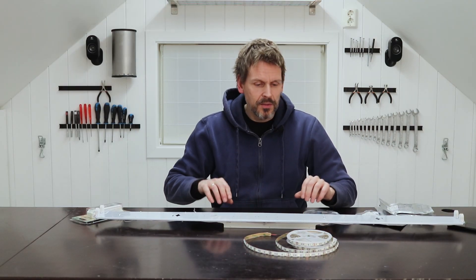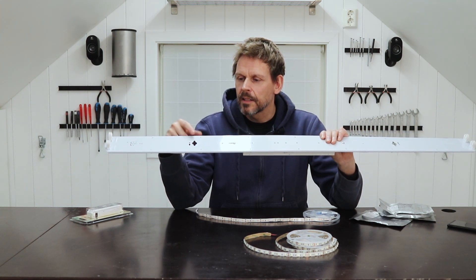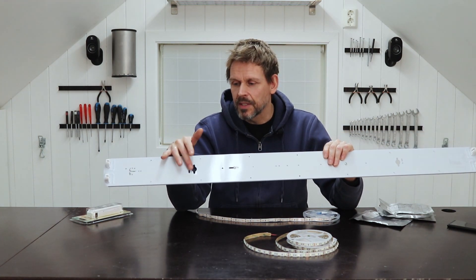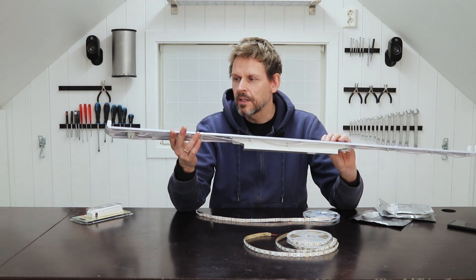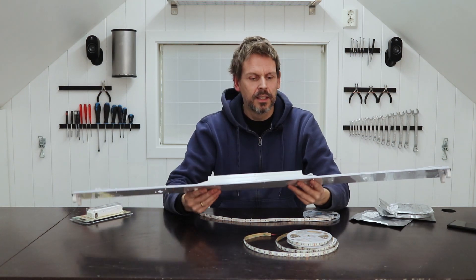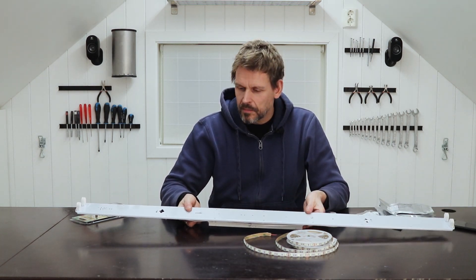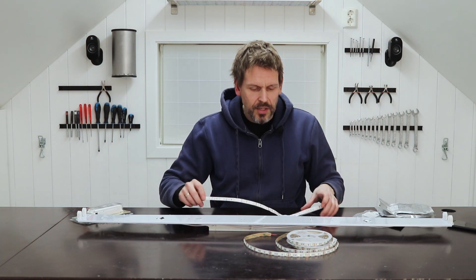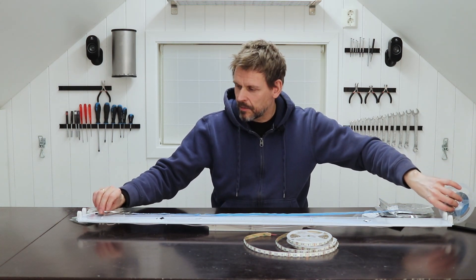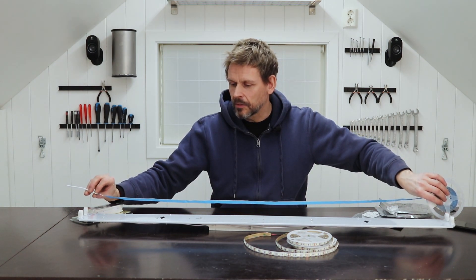I also need some other mounting mechanism, because the original one has these big holes and my LED strip will cover them. So I need another way of mounting this when it goes up into the light fixture. I will try some testing first — see how it works without gluing them on, do some soldering, cut them to appropriate length, power them on, and see how the light looks.